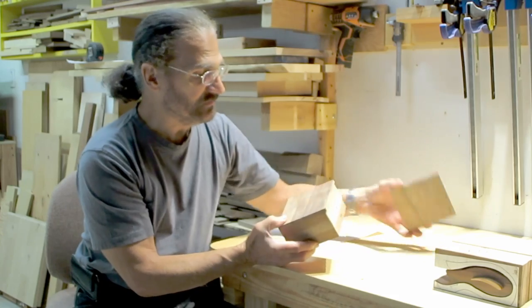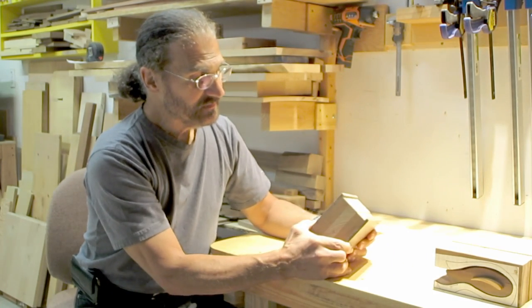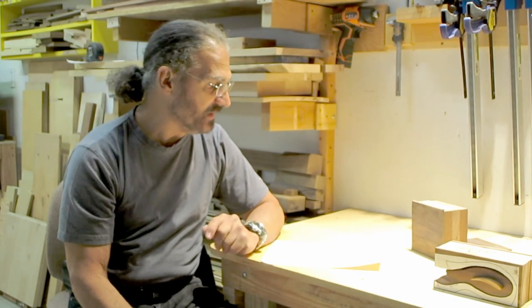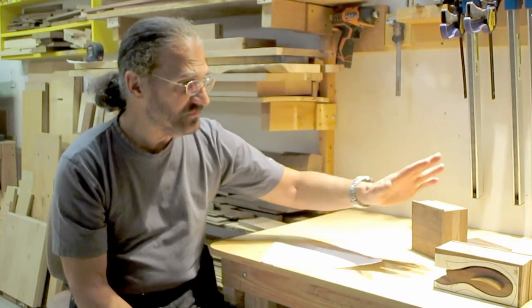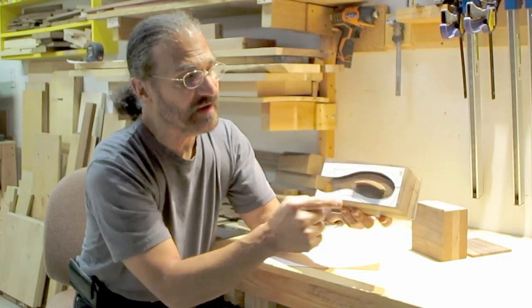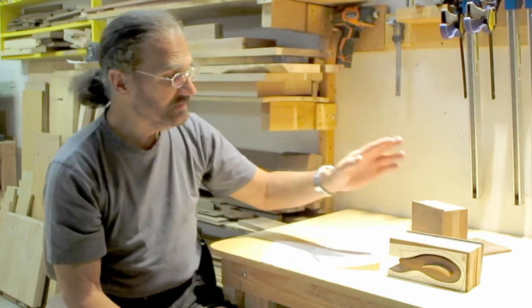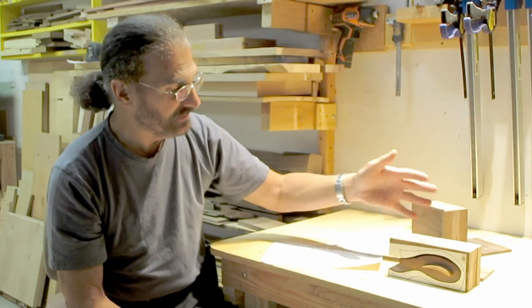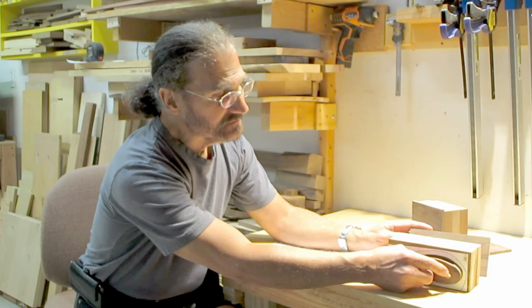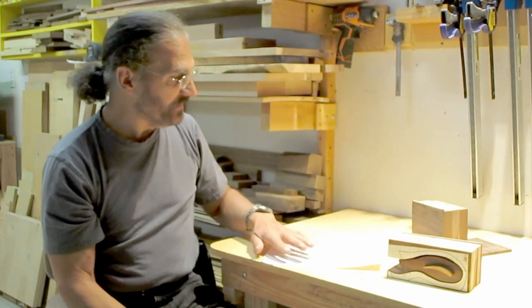Here's another one — just a glue up without the template on it. And here's the back that I'm going to use. After I cut out my drawer, I'll just glue this on and I find that a lot easier. There are generally two ways to create a bandsaw box. A lot of guys do their glue up, put their template on, and then cut out the shape, so when they cut the back off, they're cutting it off the cutout. What I like to do instead is do my glue up, prepare my back piece, then cut out my drawer, and after the drawer is all done, then I'll cut out the shape of my template — as a later step rather than up front.